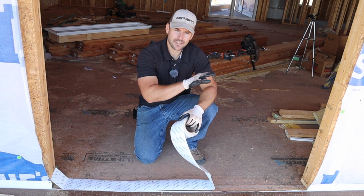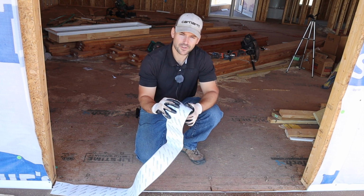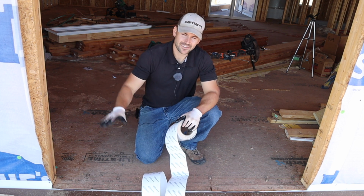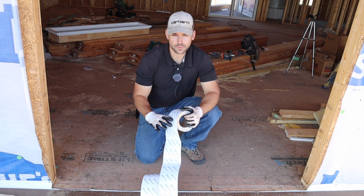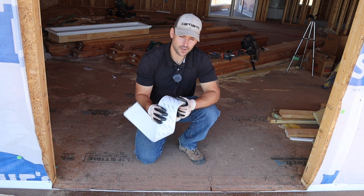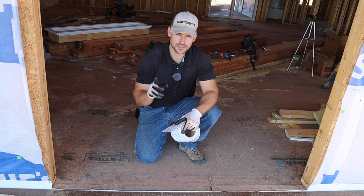And then you might need to take a couple layers depending on how wide your tape is. What that does, in case water gets under the door, it doesn't come in contact with the wood and rot out the threshold. I used to install doors, and a lot of them I took out did have rotted thresholds that did not have this tape, so be sure to do that.